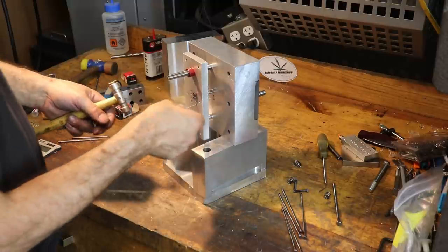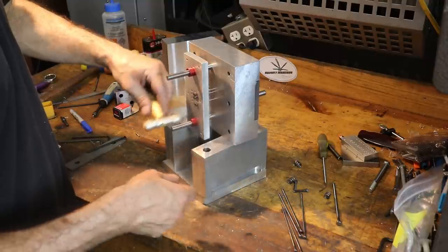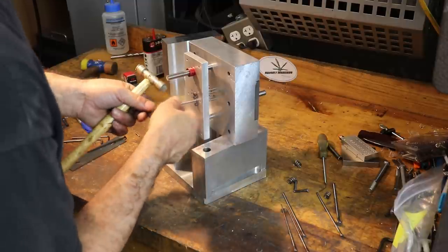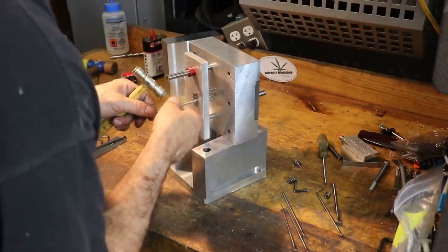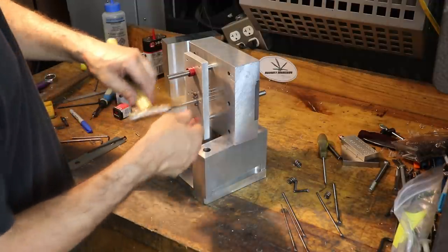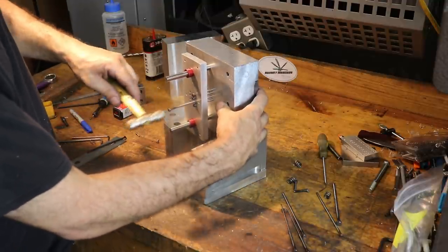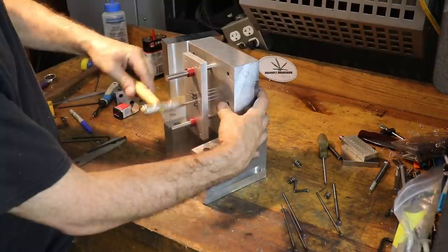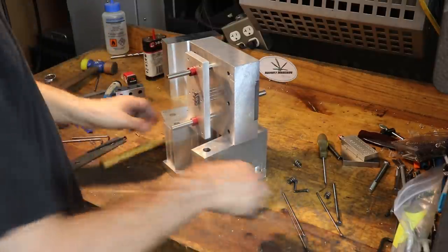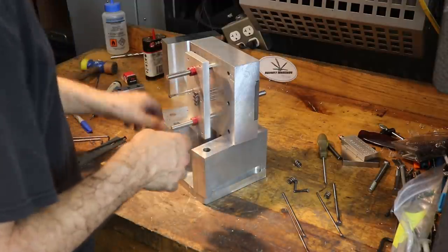Okay, so 16th inch pins on the outside and 1/8 inch pins in the middle. And we just got to convince each pin to go in by hopping over all the little cone chamfers that we added as it travels through the mold. If you overdo it, then you can start to buckle your ejector pin, and then the life of the pin is lost. Or it actually gets stuck, which sucks too. But these are just getting convinced to find their home, and there may be some micro flexing going on, but usually that's not too big of an issue.